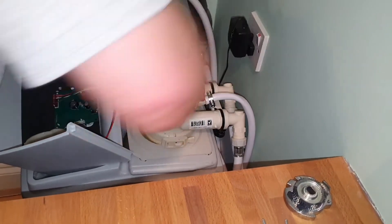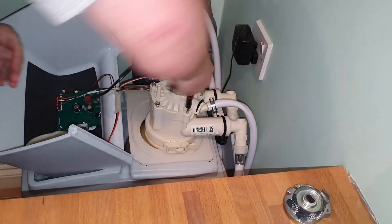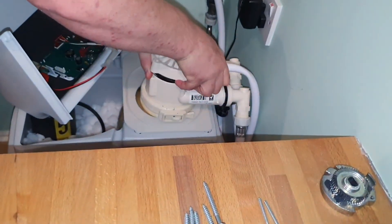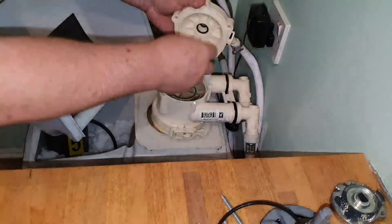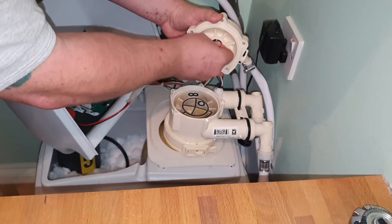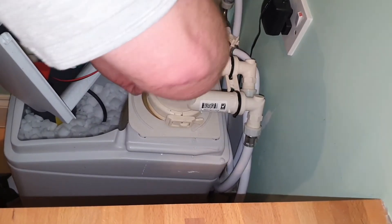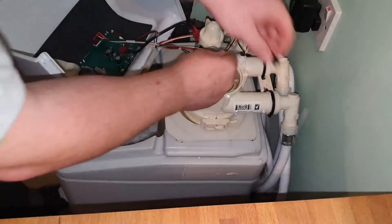Remove all those bolts — they're quite long, so it takes a few minutes. Just taking the last one out now, and a slight push-up on the valve and it will just pop off. Remove all those bits out of it. We'll take the disc out and have a look into the valve head because those two o-rings will be lodged in there. You might just have to prise them out gently without damaging any of the housing. Take out the plunger — I'm going to swap that. Also the figure-of-eight seal — I'm going to replace that. And then lastly, we take out the spider gasket.